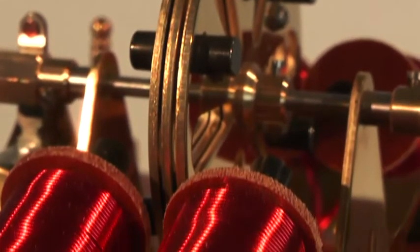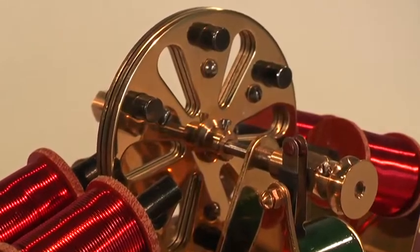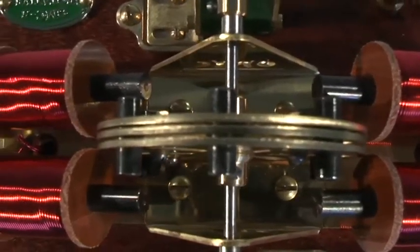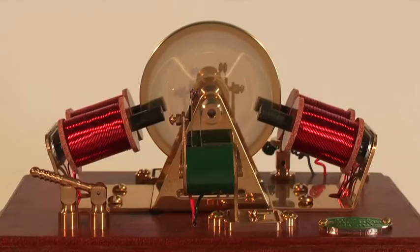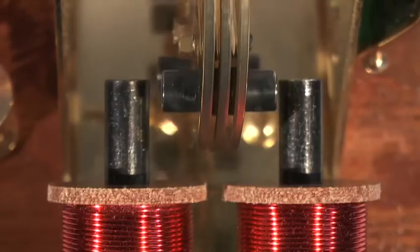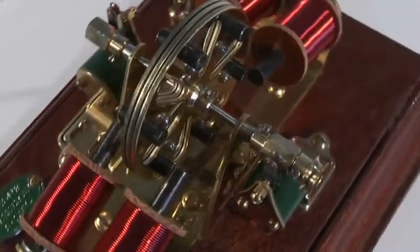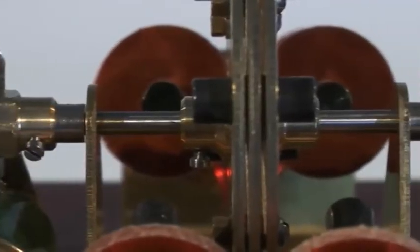This design incorporates a composite rotor made up of three discs that hold six armatures. Two banks of wound stators, one on either side of the rotor, achieve 12 power pulses per rotation as each set is independently energized as an armature approaches. This is achieved by the use of two six-sided cams to operate the timing blade sets independently but mounted on a common shaft.